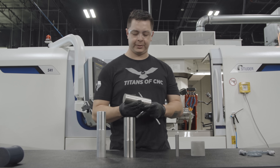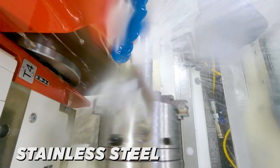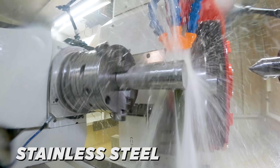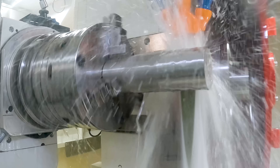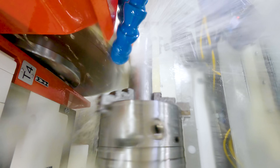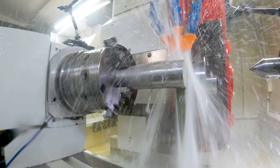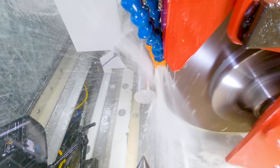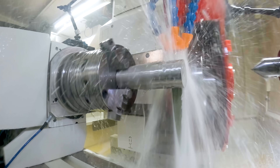Let's go ahead and grind some stainless. With the aluminum and Inconel part, we could grind down a thou and a half per pass, but since this is stainless we've got to slow that down — we're grinding down seven tenths for the roughing cycle. Stainless can be ground with an aluminum oxide wheel fairly easily, but with this grinding wheel it allows you to have one wheel for multiple parts and materials. We're all about reducing setup time and just getting the work in and getting the work out.